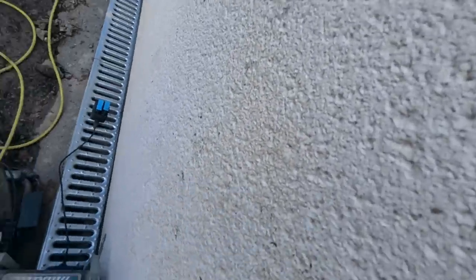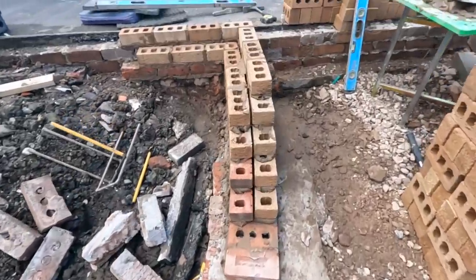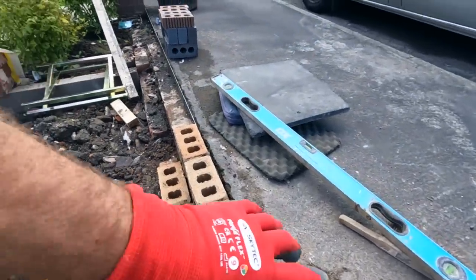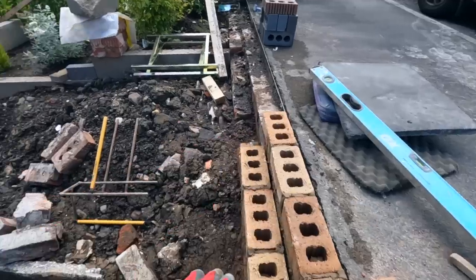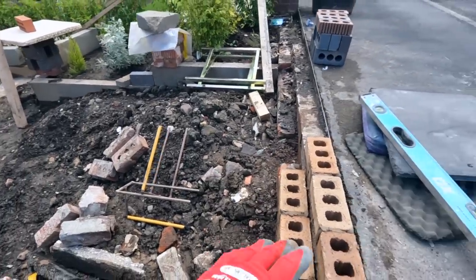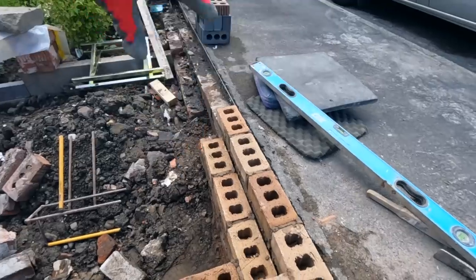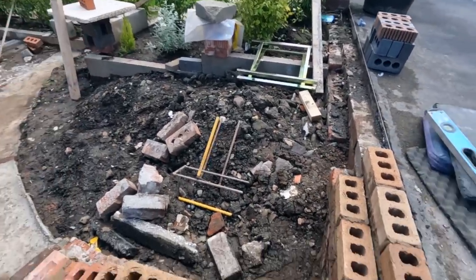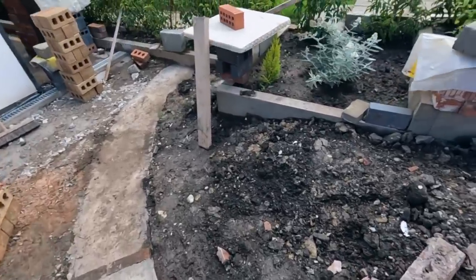My cover is way down a bit more. So, the plan now is to build this up as a square head. Square head, and then there's a drop in the wall. So there's like a three-course step there, and that's moving through. Four courses with a brick and edge on top. And I've picked up six solid blues for the ends, which are £1.70 a pop for the brick.